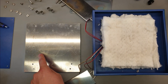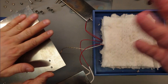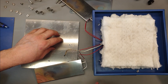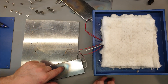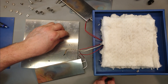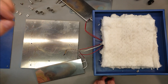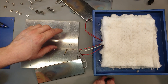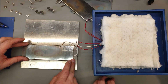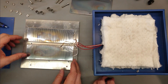Do you think there'd be any benefit to putting thermal paste between the elements? It's sandwiched and held tight against it - the heat's not going anywhere else. We don't care about the last little bit of thermal transfer like in a CPU. If we were changing the temperature up and down quickly it would probably make a bit more difference because heat can transfer quicker. But if it's just sitting there steady state, there's not really much use for thermal paste. They're making good contact anyway - it's good enough just like that.